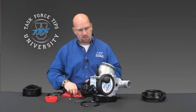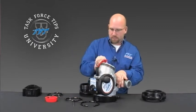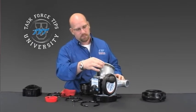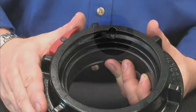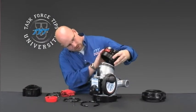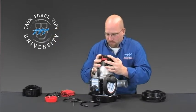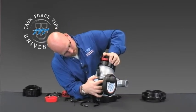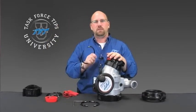Make sure the area where you'll be installing the coupling is wiped clean of any debris. This coupling will be locked out, so install the lockout ball. Looking at the mate, there will be a notch that lines up with that lockout ball. Line that notch up with the ball and press on squarely. Once the coupling is firmly seated, we're ready to install the bearing strip.